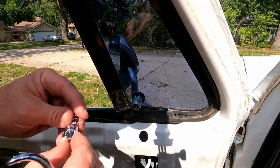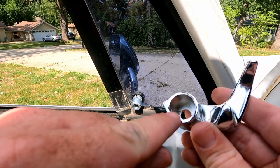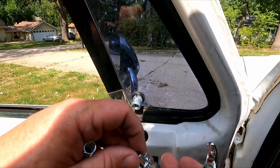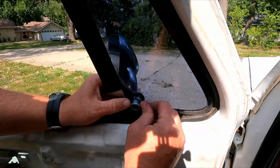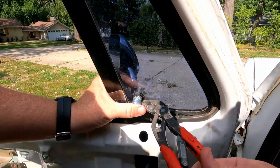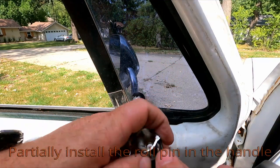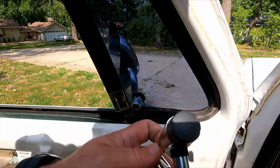This is going to fit right in there, just like that. There's a keyway inside of here — on an angle — and then there's one here. So the little ears on this button are going to lock into this keyway and allow you to actually lock it. Put the little wave spring on. I'm going to knock this roll pin in a little bit first, because it's going to be awkward to try to hold all this. I'll get it into the body first — a couple taps should do it.